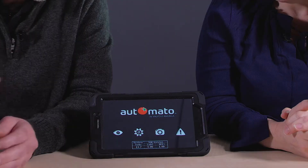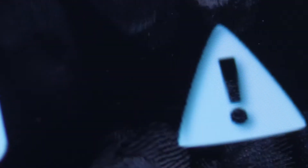There are four icons. What do all these icons mean and how does the user use them? The exclamation point is an indication for errors in the control. You can see today it's not highlighted, but just touching the icon you can see the status of your control system — we see here no errors. If there were errors, that icon would be red, indicating an error status alerting the operator he might want to check which errors he has active at the time.